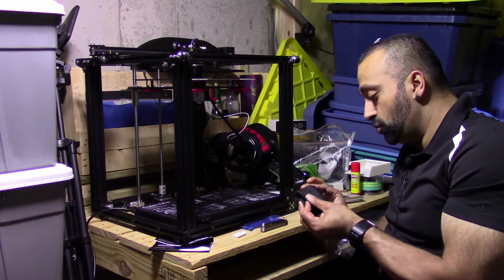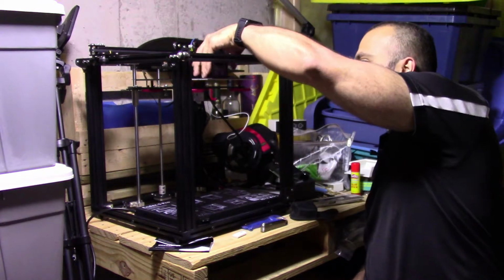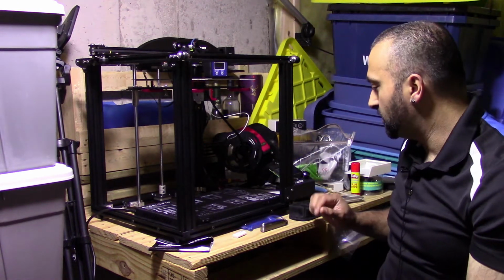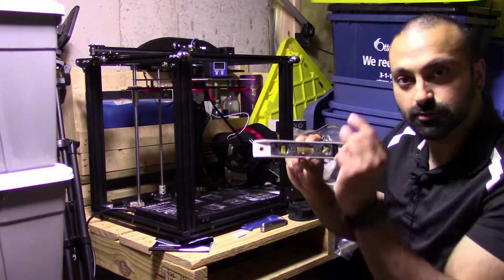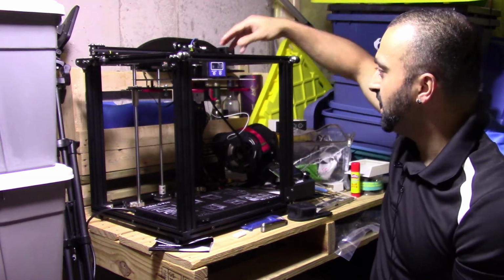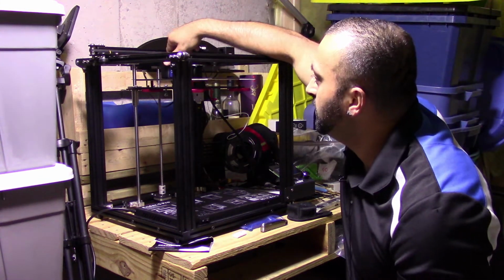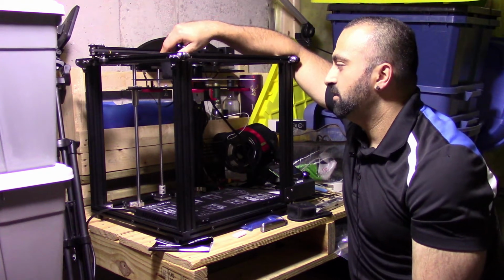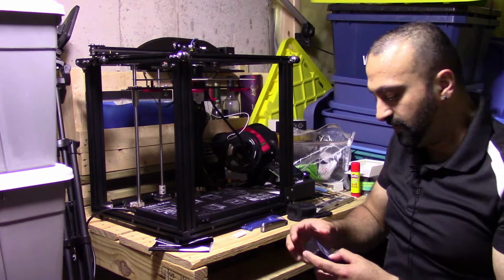So what I've been using is a digital leveler. This thing works wonders. I love it. Good investment. I paid 50 some bucks off of Amazon for it. I will also post a link at the bottom of this video for that. And I've also gone ahead and ordered more of these, but the small tiny versions. So right now, it says my bed, because I just moved the printer, I tried leveling it yesterday. It's leveled almost perfectly everywhere. I do need to make some adjustments and tweaks. I try to keep it around 0.05 at the most. When I go on the angle, actually it's leveled perfectly right now, as a matter of fact, which is great.